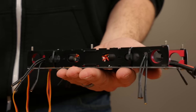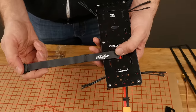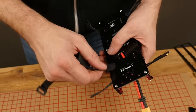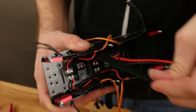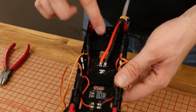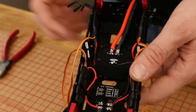We're going to go ahead and use zip ties and tighten down all four ESCs. For the battery straps, we're going to line up the strap so the Flight Test end is pointing to our right, and we're going to feed it face up down through one slot. We installed our battery straps, and in this case I left it below the lead but covered the leads here. This works really well to insulate the lead, so if anything metal touches, the straps will cover it.